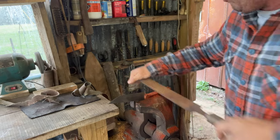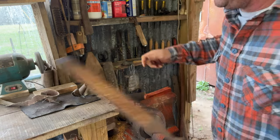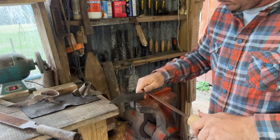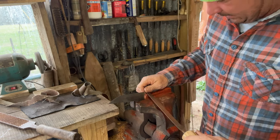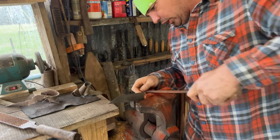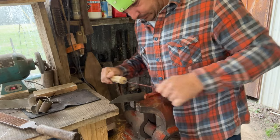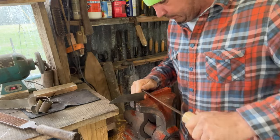I've been right here filing on this a little while. To get up in this front part of this curve I have got an arch-shaped rasp, and you don't go off the edge — you want to start at the outside, angle up and push in, then come over here and angle up. Because if you push off this edge you're gonna pull a chip of wood off — ask me how I know. Basically I'm just hand filing this whole knife into the shape I want.